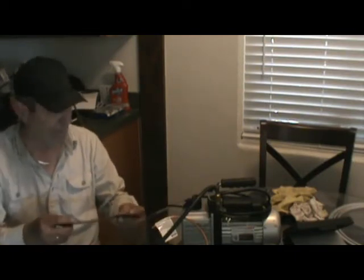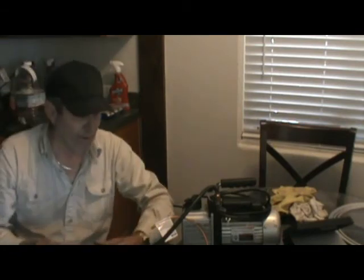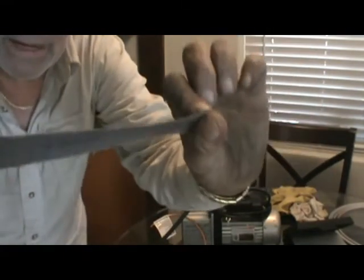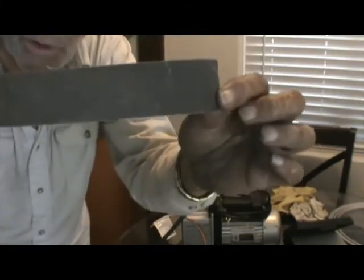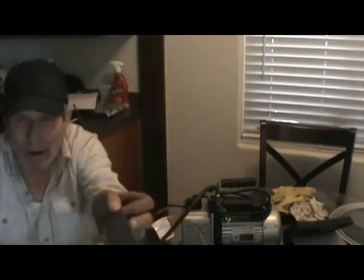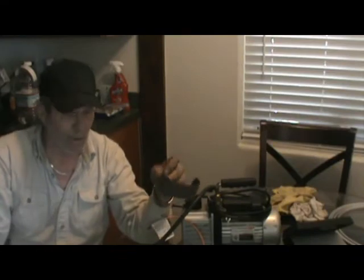Now, one other thing that I want to mention, I'm seeing a lot of this. Guys are going on YouTube instead of learning the proper way, and they're just going by other guys' ways that are not the most effective. This is emery cloth. Okay, they have like a screen hole emery cloth with holes in it. Also, it's like a greenish blue. But this is emery cloth. Okay, see how fine grit that is? That's emery cloth. Do not use a wire brush. Don't use a wire brush.